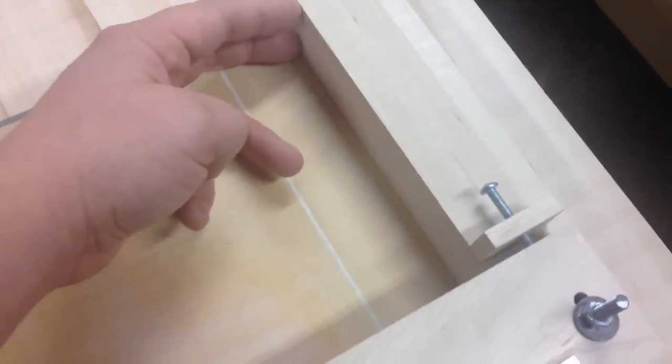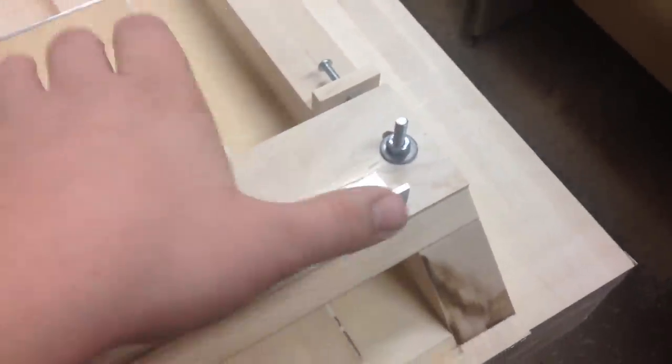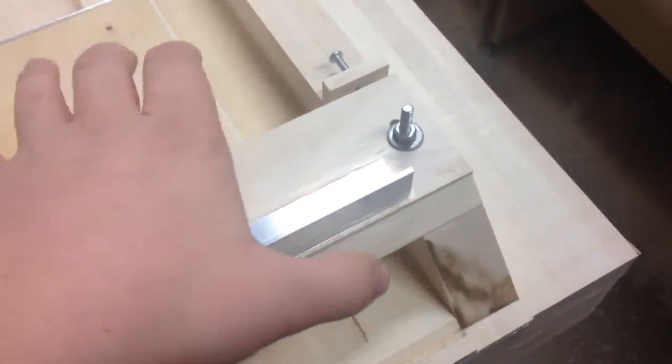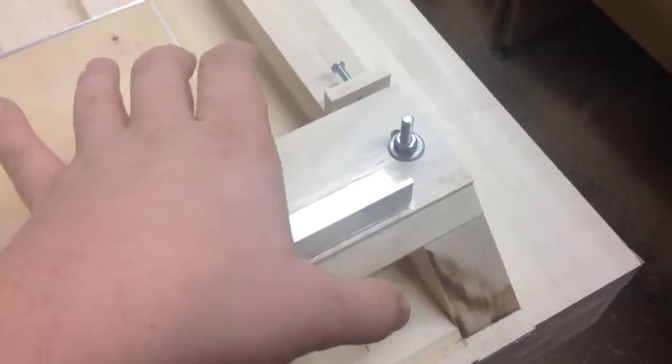The other thing I'm probably going to do is put a couple of holes and swage some screws that come out here and up here to make a sacrificial fence. That way I can adjust the angle to make it more of a compound miter adjustment — just to help fine tune those angles. I'll probably do the same thing on the other side so that you can shoot in either direction.